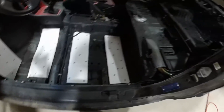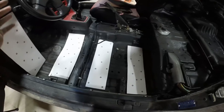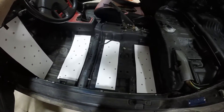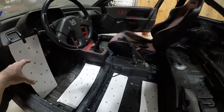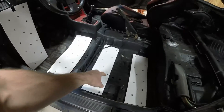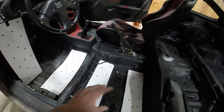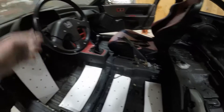It would be great to scan the entire vehicle and have everything modeled, but in real life that's such a huge file, so much data to process, it's just not worth it in the long run. The idea is to be as efficient as possible, hit the points that I need to, and transfer my geometry up here to the steering wheel so I have all my reference geometry laid out ready to go. The points on the cardboard paper are potentially reusable — I'll be able to peel these up, not the individual targets, but the entire piece of poster board. I can reuse that elsewhere for scanning another car or object. The only positioning targets that aren't going to be reused are the ones on the steering wheel.